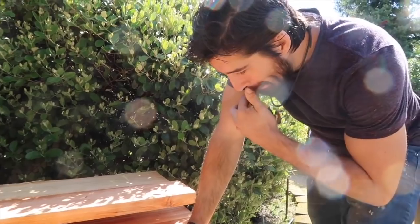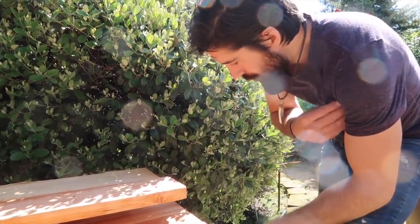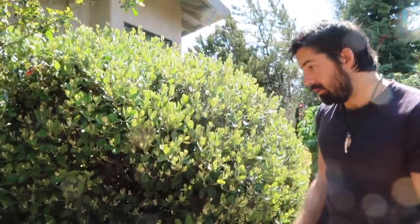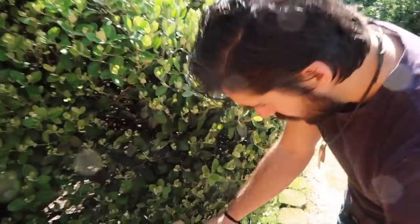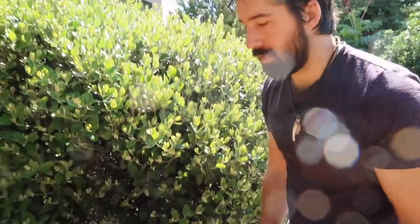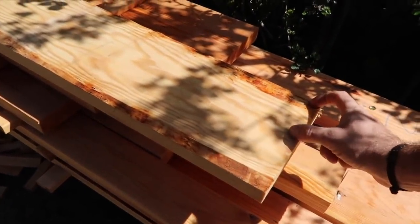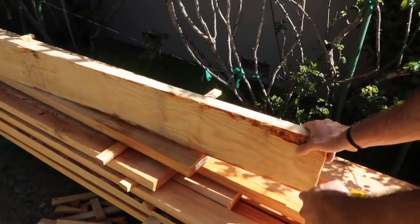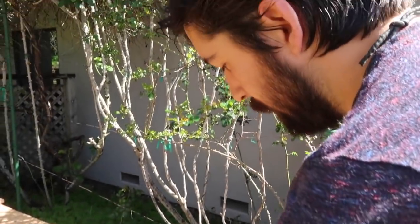On all of these, minimum you're going to have to burn an eighth just to get rid of that rounded edge. So I could get three inches out of the big ones. The plan is to leave them one inch thick and three inches wide — that'll be the planking for the bulwarks. We'll take the wider boards, cut them into whatever widths we need for the planks, then flip them up on edge and cut them down to one inch thick, since this is all inch-and-a-half stock and we don't need inch-and-a-half planking for our bulwarks.